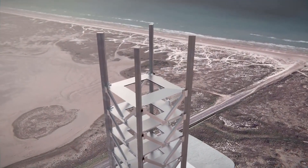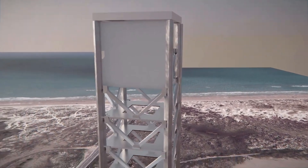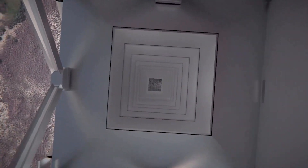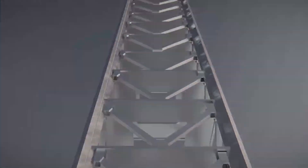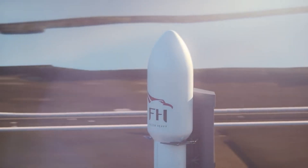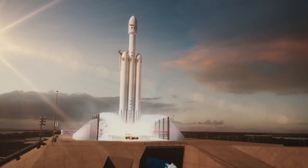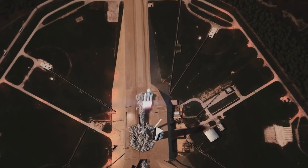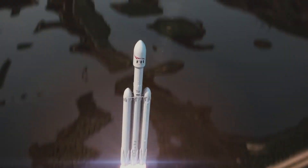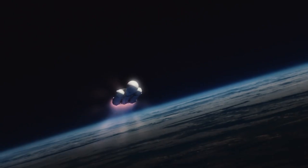In order to be able to move up and down the tower easily, there are bearing skates that the carriage attaches to on the sides of each column on the top and bottom. This carriage section will attach to the pulley at the top via a cable that goes down the tower and connects to a winch at the south base of the tower and a spool at the west base of the tower. The winch will be used to pull and push the arms up and down the tower so that they can catch and pick up the booster and the ship. The arms themselves will be actuated by linear hydraulic actuators. In order to make sure that the tower places the booster and ship in the correct position, the catching arms will have tracks on the top so that the vehicle can be translated into the right position. The QD arm, much like the booster QD, will supply the ship with CH4, LOX and helium as well as external power prior to launch. The QD arm has a single actuation point which is connected to the tower and allows the arm to move during launch and catch operations. The extension has a claw setup similar to the top of the Falcon 9 strongback, which will hook up to the booster for stabilization.